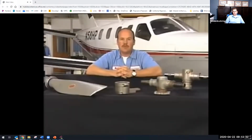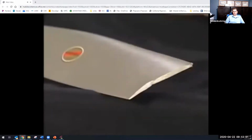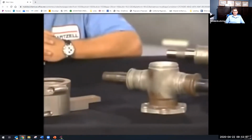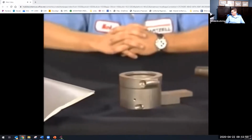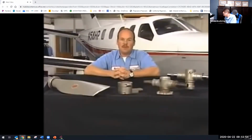Propeller failures are normally the result of fatigue and are usually attributed to one of the following: corrosion that has gone untreated, nicks that were not dressed out or dressed out improperly, previous history of ground or foreign object strikes, operation in a placarded range or outside of the certified operating range. The inspections that I have talked about earlier may seem like common sense, and they are, but they must be performed properly and on a regular basis, per the appropriate manual.